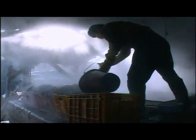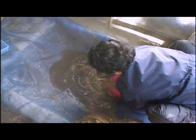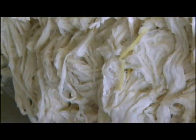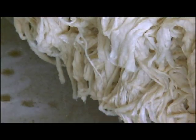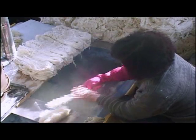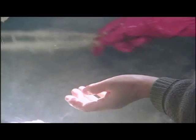After being steamed, the mulberry tree is dried, during which the bark, baekdak, is peeled off. To soften the fiber of the bark, baekdak is boiled in water again. Water dissolved with vegetable ashes is put in to remove impurities. The pure baekdak is then cleansed in clean water and dried in the sun to bleach.